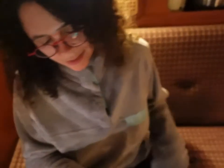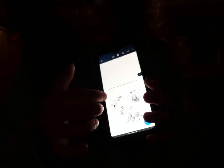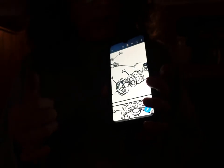I'll look at the parts diagram and see. I don't remember there being a gasket when I took that off, but I might just not remember. Looking at the exhaust riser in the diagram — this is the exhaust manifold, heat exchanger and exhaust riser section. Zooming in on item 32 — there's definitely a gasket that's supposed to go in there that I don't have right now.